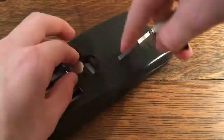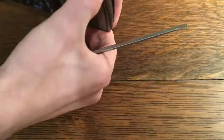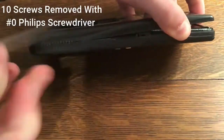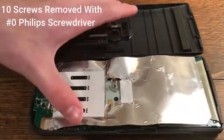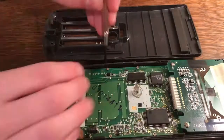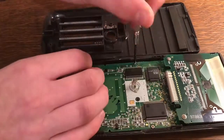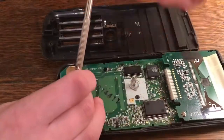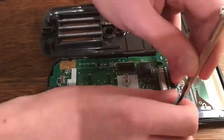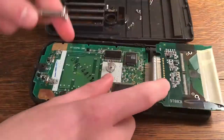When taking the calculator apart, there are two screws on the back. Take those two screws out as well as the batteries and the small button battery — you will have to remove a screw for that. You have to apply a little bit of force when forcing apart the calculator. There are 10 screws total that you will need to remove, and you can use a number zero Phillips for this. Six of them are on the bottom plate, two are hidden up next to the screen plate, and two more connect the actual screen to where it sits.